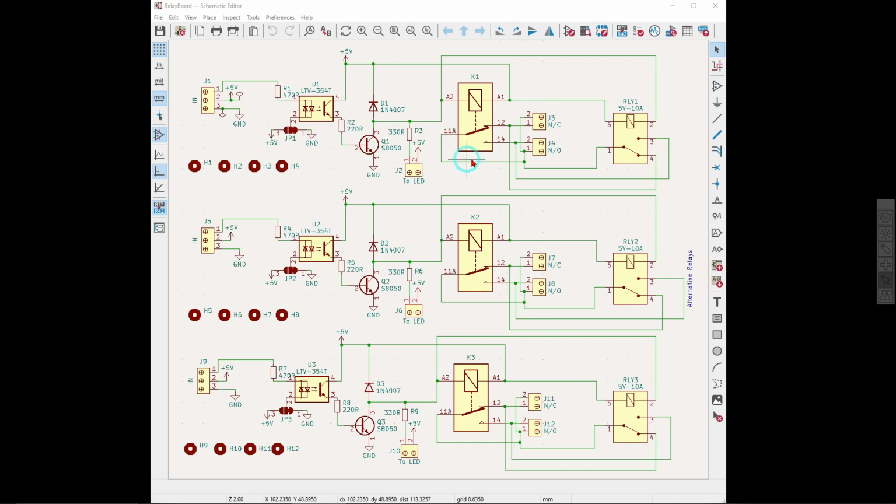so that in case you're using this with a high AC voltage, it is actually separated from the circuit with an optocoupler, so that no high voltage can actually get into the inputs here. And what I've decided to use is this LTV354T opto isolator, Lite-On or whatever company makes those. I bought 100 of them for $8.80 on AliExpress with free shipping, so they are nice and cheap.